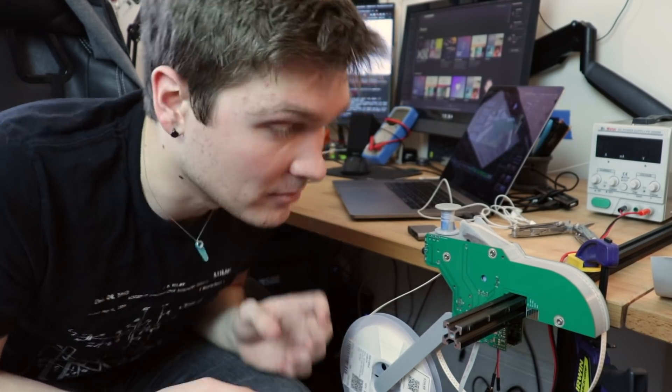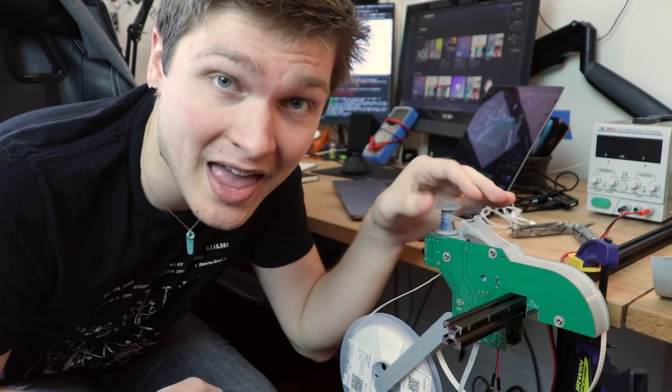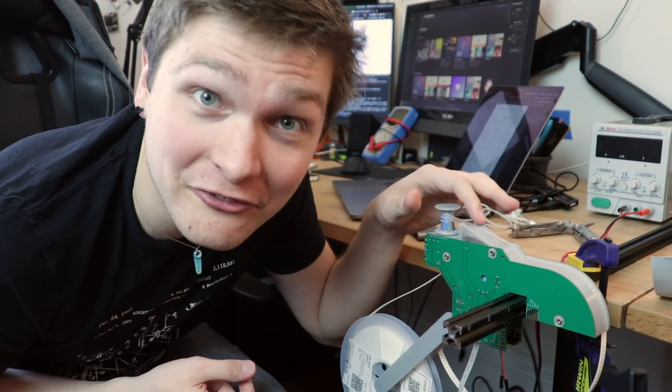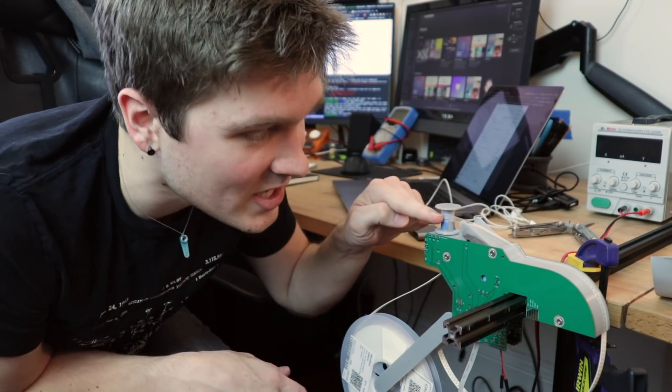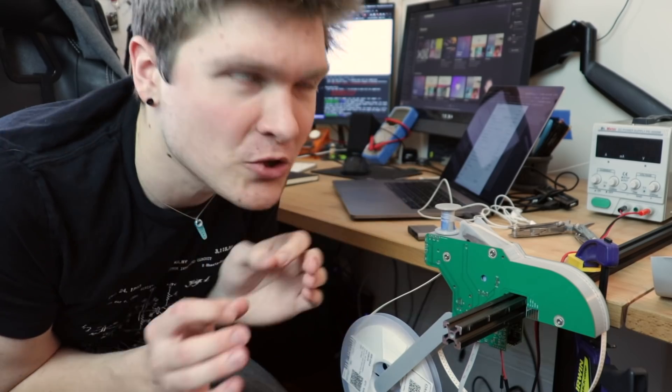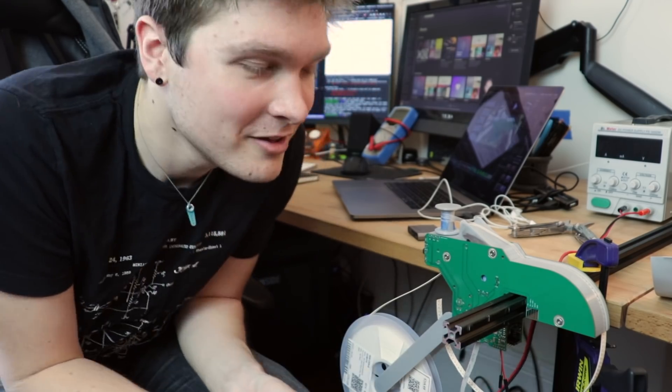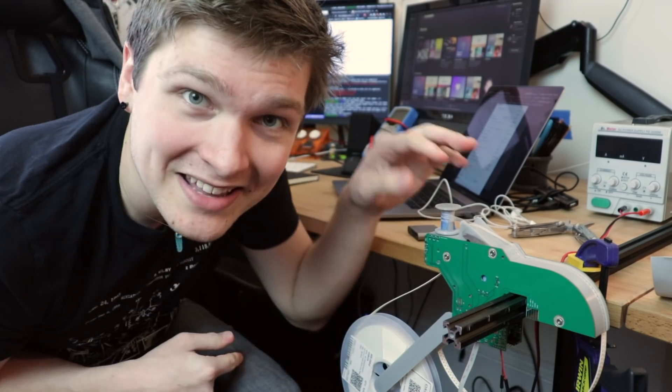This is awesome and cool, but it's not really doing anything new from the last one. Sure, all this stuff is shifted back a little bit and it no longer collides with the head while the camera's looking at the parts. The magnetic sensor works super well for determining whether the film guide has been pulled all the way down — I just put one single little magnet inside the guide, and when it comes to just about center point with the spool, it triggers, so it's perfect spacing. Also, it's running on 12 volts now instead of 5, so the buck converter works really, really well. But the whole point of making this new feeder is to switch to the one-wire EEPROM. So let's solder up one of the new feeder floors with the DS2431 EEPROM and see if we can get it to recognize what slot it's in based on that.